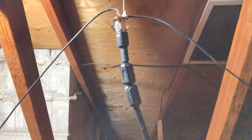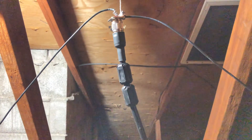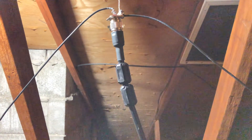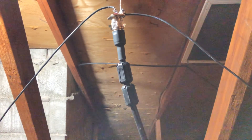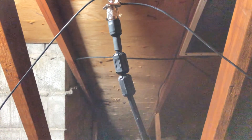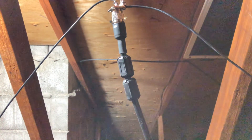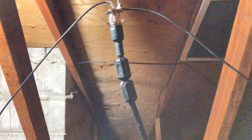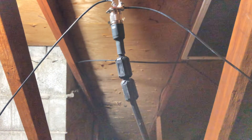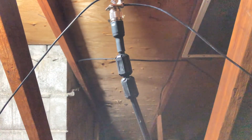When I hooked it up to my radio, I really wasn't showing anything on the Yaesu, which was crazy. I think having a 50-foot run on this thing is giving me that low SWR. It's also good on the FM portion, so for all your two meter repeaters it's flat — on the Nano VNA it was pretty much 1.0 to 1.1 to 1, which I was very surprised to find out.